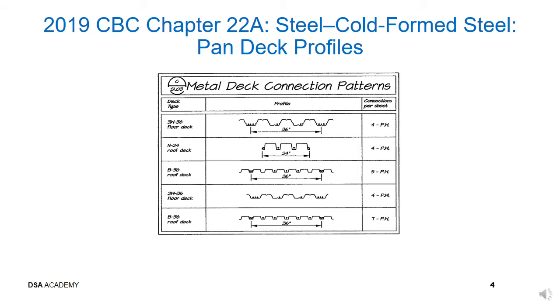This slide presents a typical metal deck welding pattern. The CWI needs to make sure the welder provides the correct number, size, and pattern. The PI should also walk the deck for personal knowledge and to verify the ability of the CWI in providing the required inspection.